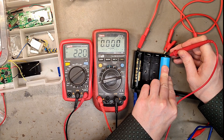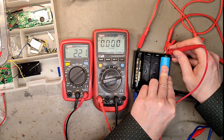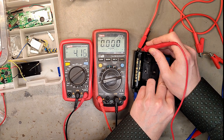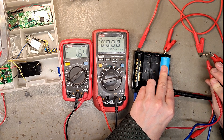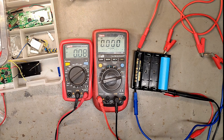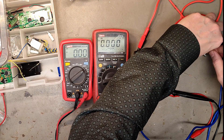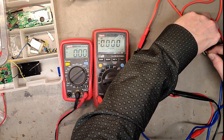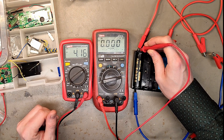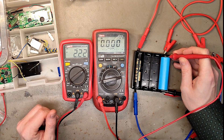Maybe I actually have 2.2 volts — yes, 2.21 volts. So maybe it's working. The donor is at 4.16. It's reading 2.21 consistently, so I think it's going up but it's going very very very slow. If it's a higher resistance it should probably go even slower. Now it's 2.22, donor still at 4.16.